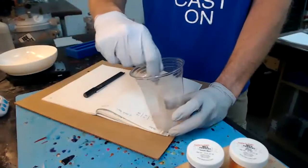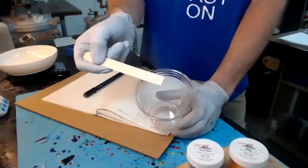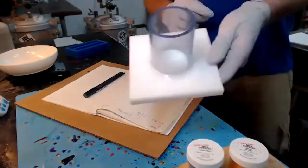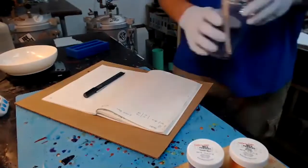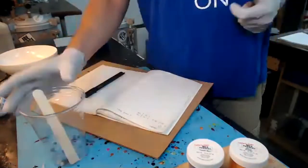So the best way is, when you're mixing, pull out a little bit on your stir stick. If you can see the wood grain, that stuff's going to be see-through by the time you're done turning it into a pen blank. Now, if you're making something like a bottle stopper or bigger, then whatever's in the cup is going to give you a good idea of how the blank's actually going to look, because it's the same mass. So that's kind of how I did it.